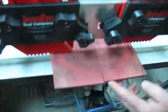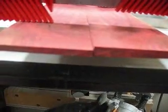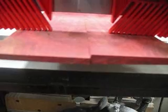The last clamp. You can see how out of position we are right here on the very ends of the two boards. They're two different thicknesses. The Paraline clamp is going to keep one edge perfectly flat. So this side's already locked. I'm going to put this side down, put pressure down here. I'm going to lock it into place.